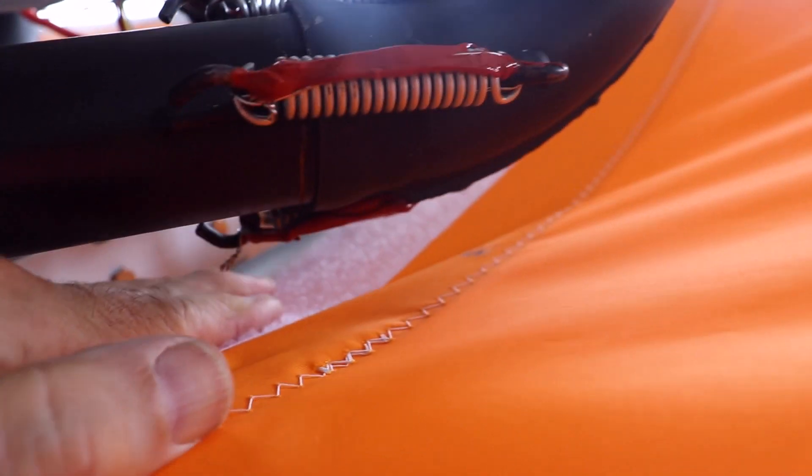What I'll also do when I get the gap seal in is I'll take a wire tie and pull that fabric right down tight. This compression strut here will help hold it out of the way. Here's the compression strut right here — we'll just bring that down tight, wire tie around there. It should give you plenty of clearance on that exhaust manifold.